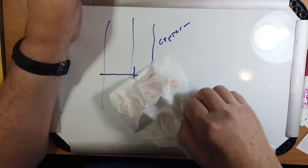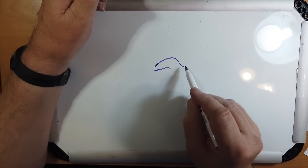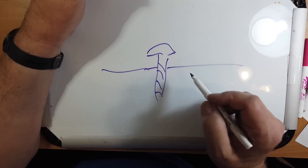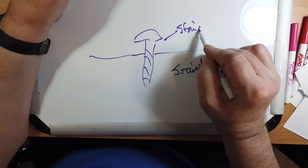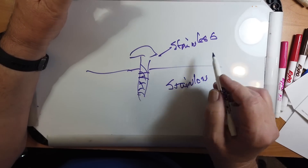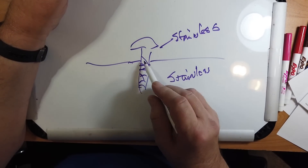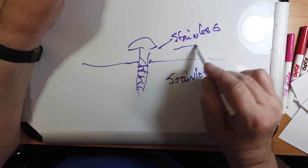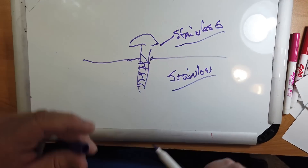One other thing: if you're putting stainless steel screws into stainless steel hardware, after a while the screw can become very difficult to remove — it binds. There is a compound you can put on the screw before installing it that will still make a solid mechanical connection, but keeps those stainless steel parts free to move so you can take them out without drilling them out.